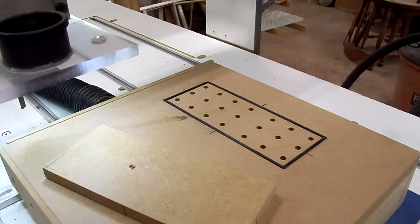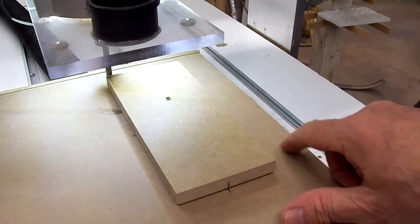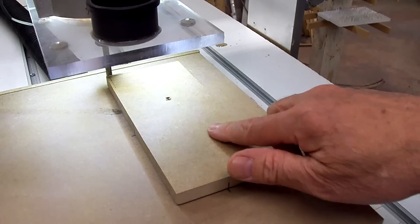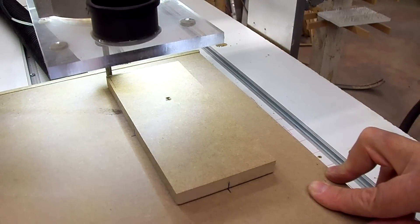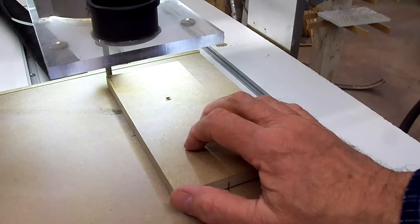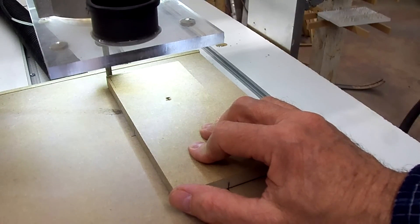Well, that was real stupid — I don't know what button I hit. I meant to zero out the Z axis and I don't know what I hit. I had a little mishap when I was trying to zero the Z axis and ended up plunging into the board and dragging it across. Got everything back to where it's supposed to be zeroed out and I'm going to use this damaged piece as my first one just as a trial piece. I got a brand new router bit on there so hopefully it's sharp enough where it won't drag too much. With the vacuum on, if you pull real hard up you can't pull it loose, but if you drag to the side you can. So hopefully I've got the feed rate not too fast and not too deep of a cut to where it will drag it off, but hopefully it'll be okay. So we'll turn the vacuum on and router on and get started.